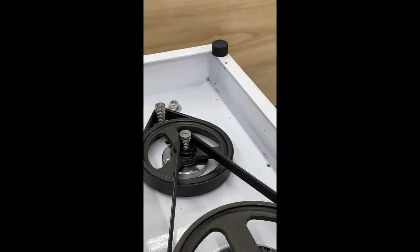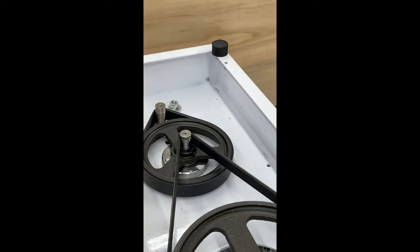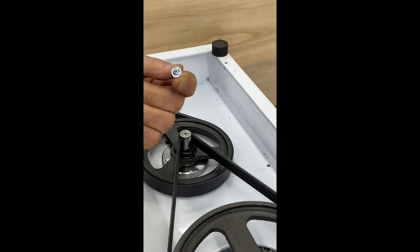This video is going to show how to extract the screw from a Famag mixer panel when the head of the screw has been snapped off due to over torquing. These mixers like the Famag 5, 8, and 10 have screws like this holding the bottom, back, and top covers on. We recommend using a hand screwdriver to remove these.